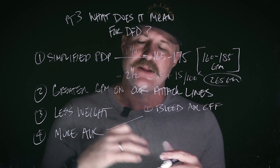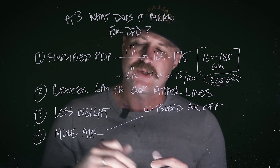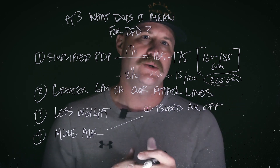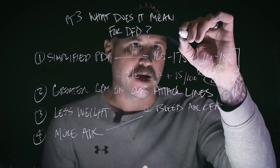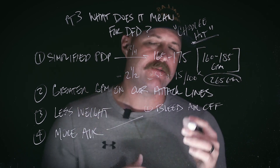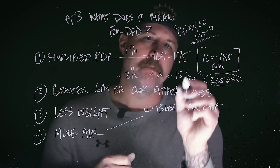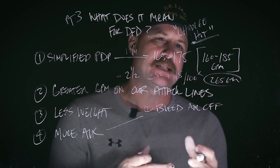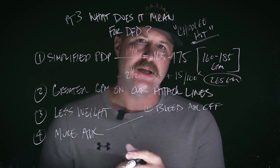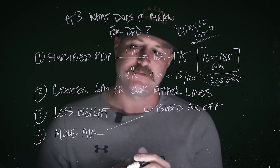When charging your lines, we recommend charging them hot. This applies regardless of whether you're on a Pierce or Spartan apparatus, using true ID hose, Echo 10, or national hose. Charging hot means charging that line with 185 to 200 pounds of pressure, and then when you're bleeding the air off, backing it down to your 165 to 175 — or wherever you've dialed it in for your crew during hands-on training — while that air is being bled off.